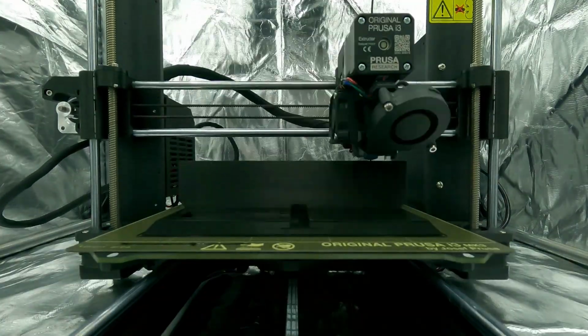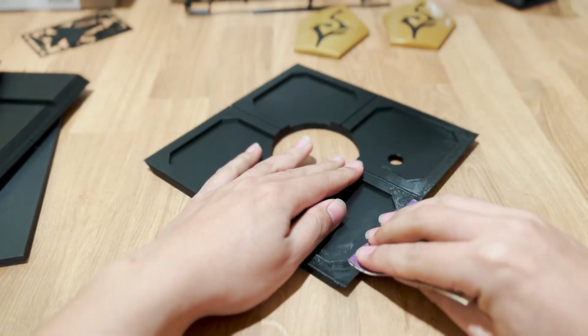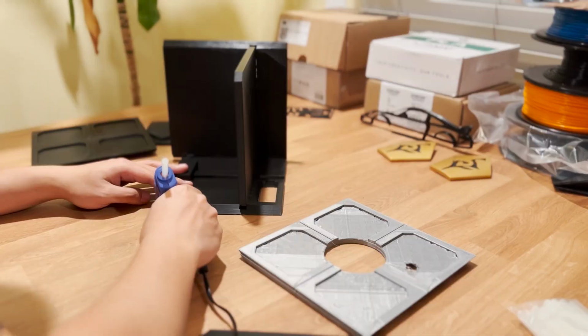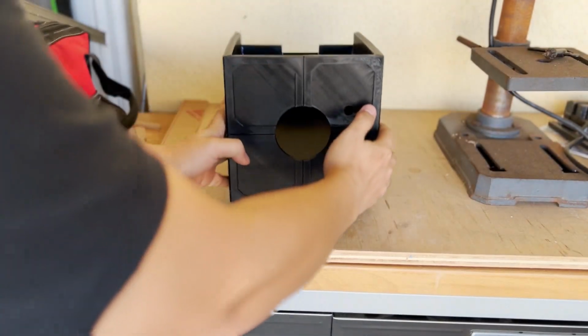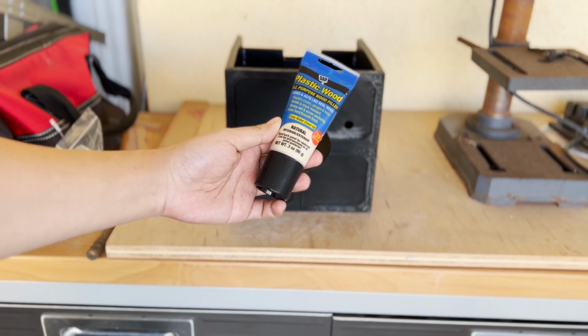After what seemed like 100 hours of printing, the walls of the box are finally ready. I have to sand some of the imperfections that appeared from either over-extruding or from not having enough infill. Also, since some of the parts slightly warped during printing, I'm going to have to assemble the box before painting. This gives me an opportunity to fill in some of the gaps with plastic putty before priming the box for paint.